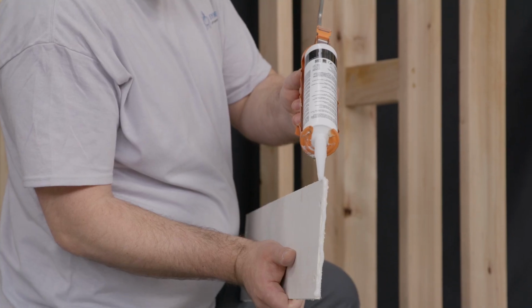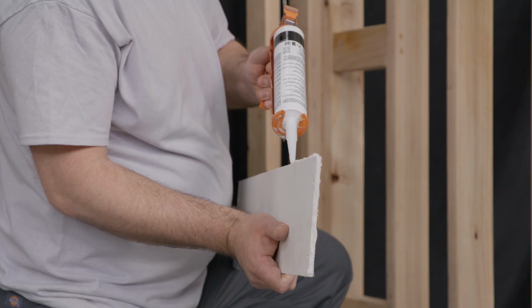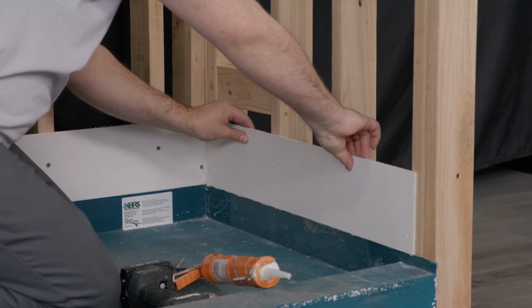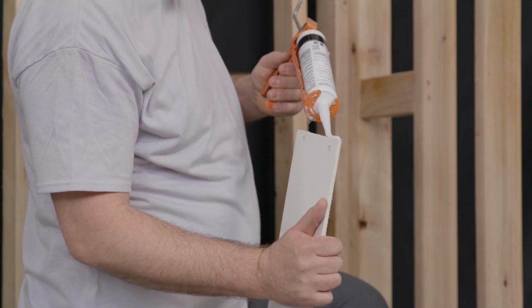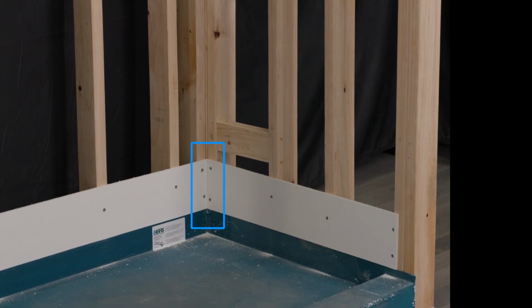at the bottom. Install the shower pan skirts on the left and right return walls using the same steps and methodology as above, but trimming them to fit between the 1/4 inch moisture-resistant strip and the back wall pan skirt. Add a heavy bead of clear sealant on the back edge of the skirt where it abuts the pan skirt on the back wall.